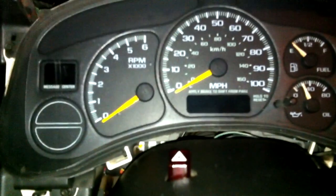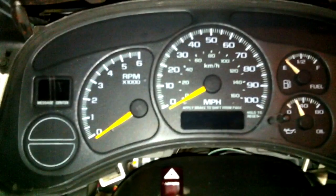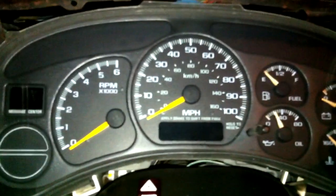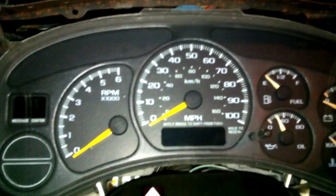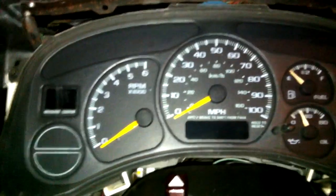It's looking like we got an electrical issue with this. I have noticed that it has intermittently gone out and then back on, but now it's completely off — even when I go to start the motor. So I think it's a loose connection. It makes sense because it was doing it intermittently before, so it's not like it just died. I think it was aggravated when I was down here beating on the blower motor to get it to turn on.